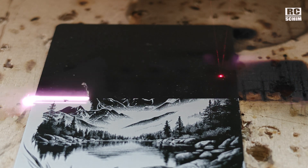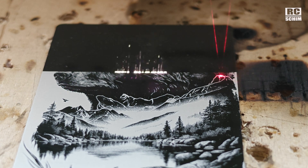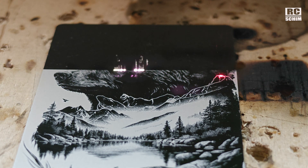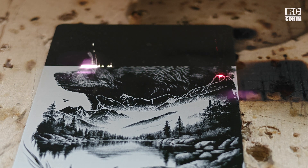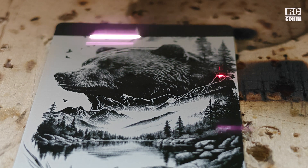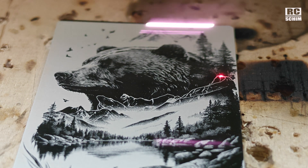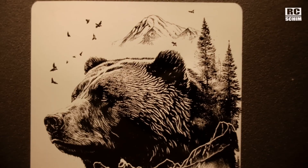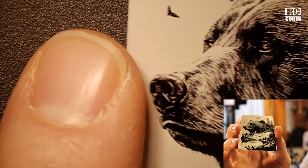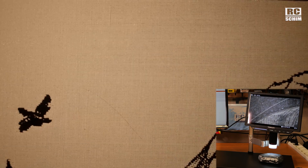Bear in mind I'm using 600 lines per inch, so that's quite a high resolution. With a conventional moving-head laser type you would probably engrave forever. And this is just a JPEG image with some clever contrast enhancements, and it shoots all the way to the top. I played around a bit with the laser and already produced this — I used a digital microscope to get really good close-ups of the things I engraved to see how accurate the laser really is, and it's damn accurate.